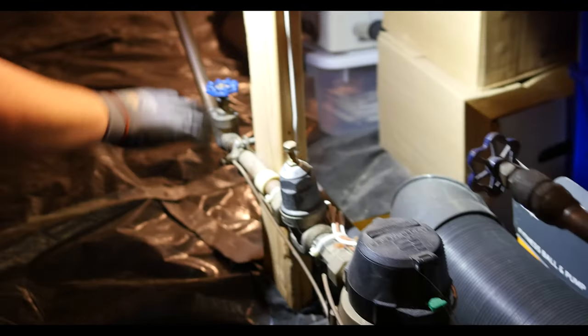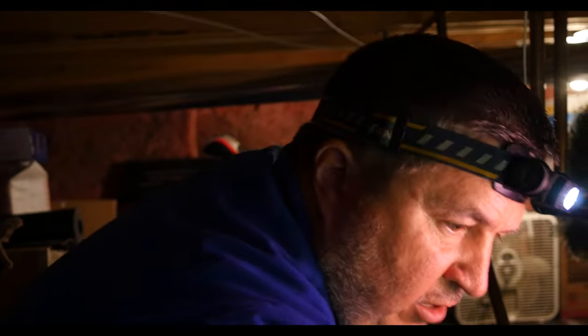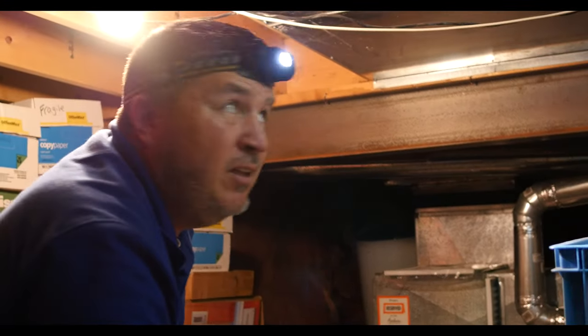You can see there were inspection restrictions because of the stuff in here. Take a picture of the water shutoff valve. There are two of them here — clients often ask why there are two, and it's so the utility company can shut off the meter and replace it. If you're telling people where to shut off the water, I always go toward the one closest to the street. If something happens between here and the meter, you know to shut that one off, so always point out the closest one to the street.